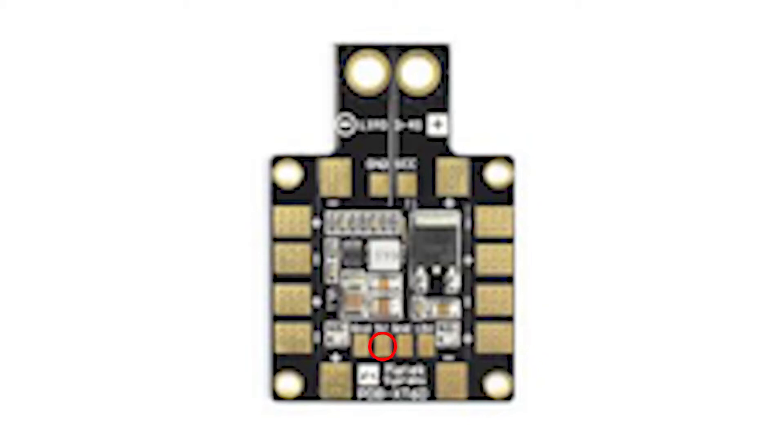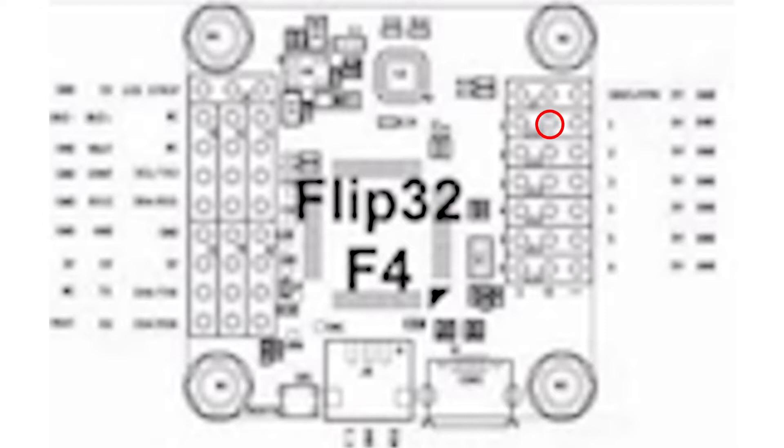After doing some testing — I'd turn it on, wait, it would reboot itself, I'd try to fly, it would reboot itself — I resolved this issue by connecting the 5-volt output of the PDB to the 5-volt rail on the flight controller. So now the 5 volts was being powered both by the voltage regulator on the flight controller and the voltage regulator on the PDB. Once I made that change I didn't have any more power issues. If you have the Revo F4 flight controller, be aware that if you're trying to power anything beyond just the flight controller on that 5-volt rail, you're probably going to run into issues. I definitely recommend connecting the 5-volt output to the 5-volt rail of the flight controller, and your issues should go away as long as you have a decent PDB.